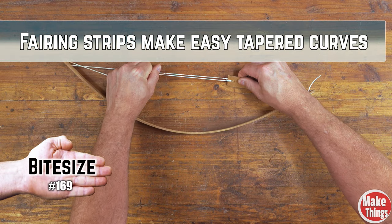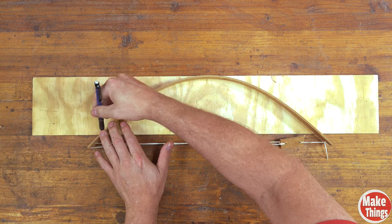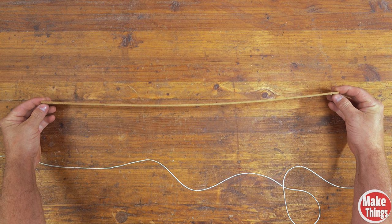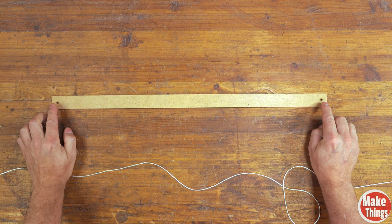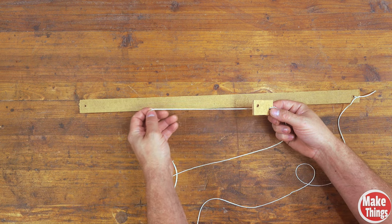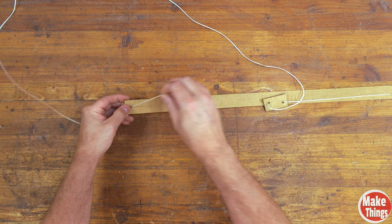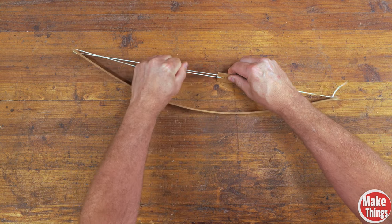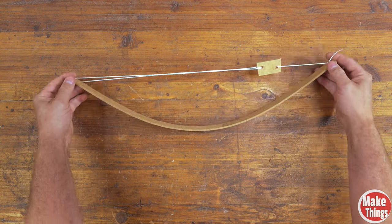A fairing stick is a thin strip of wood that, when bent, creates a curve between two points. They're often used to make arches in furniture where finding a curve would be difficult. The standard way of making these is to use a piece of hardboard with a couple of holes drilled on either end — a string is strung through the holes and through a smaller strip, and after a few knots you'll have a bendable piece that you can shape, with a locking strip that's loosened and tightened by pulling on the smaller strip. This is complicated, though.